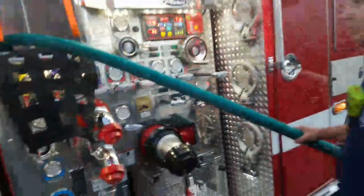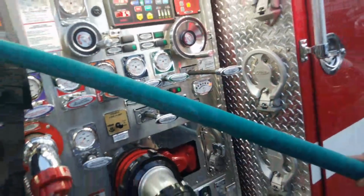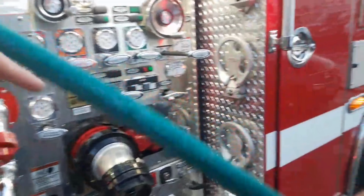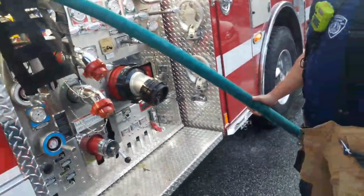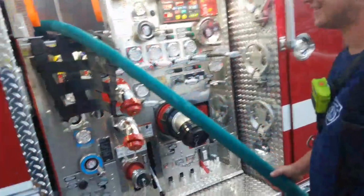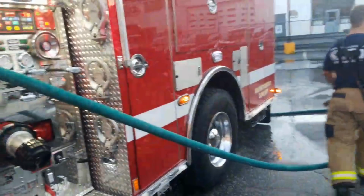The reason you need less pressure is because the biggest determinant you need pressure to overcome is friction loss. Since these tubes are smaller, water has to cram to get through this line, and therefore you have more friction loss than you do in a bigger one. For this, you're using a Q squared formula. Let's say it's 200 feet. It's 12 Q squared for this line, and your Q is 1.75 on these nozzles. So doing street math, 2 times 12 is 24, that is your Q squared.